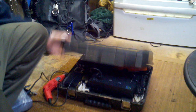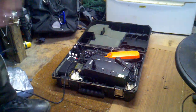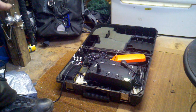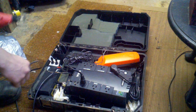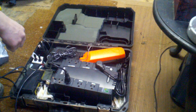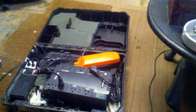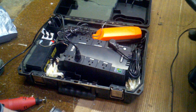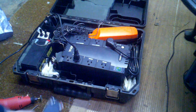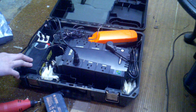And finally we've got this right here - this is a new one, a crazy idea that I had. It involves taking one of those surge protector uninterruptible power supply units made for computers - it was heavy duty. The idea was to plug it into itself, so it's running on a loop now. I took it apart, took out the inside battery - it had a little internal battery that was like 25 minutes. I just keep that as a backup now. I ran the wire out here to the big battery - this is a 9 amp hour battery.